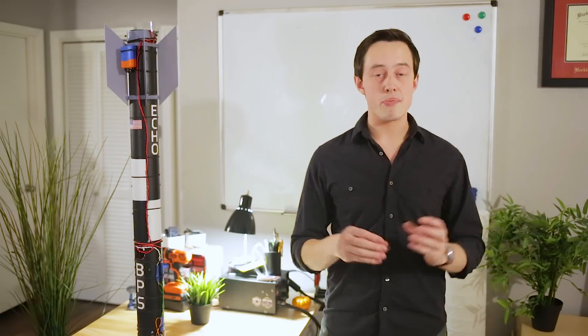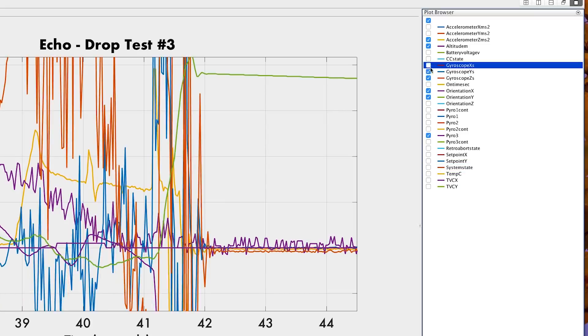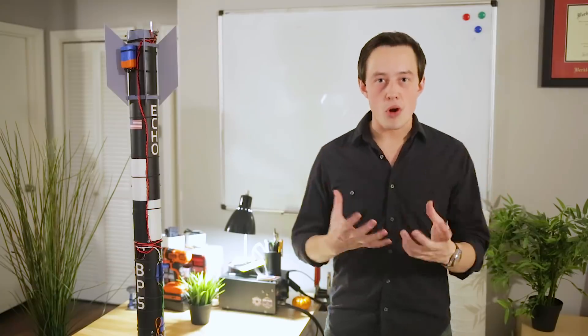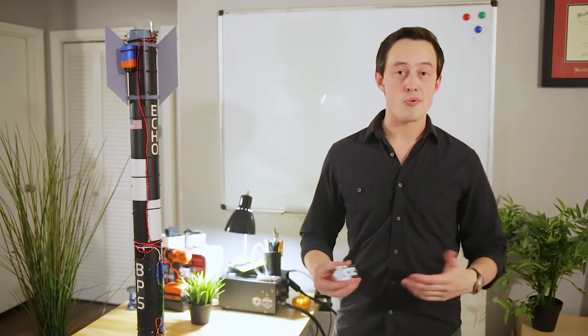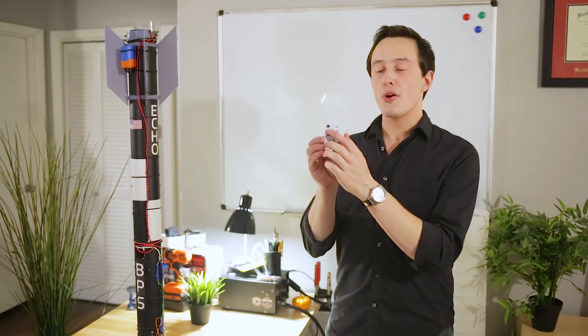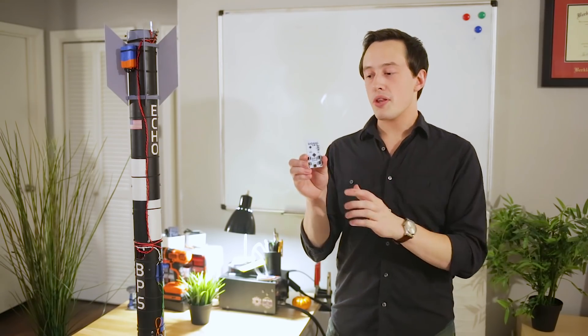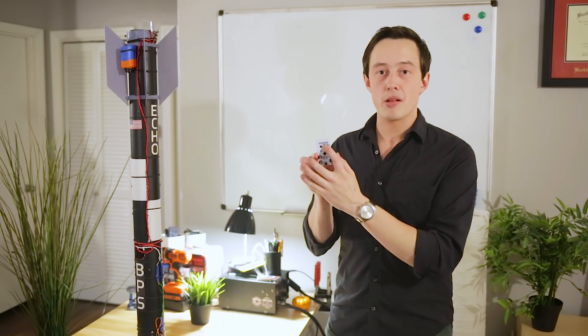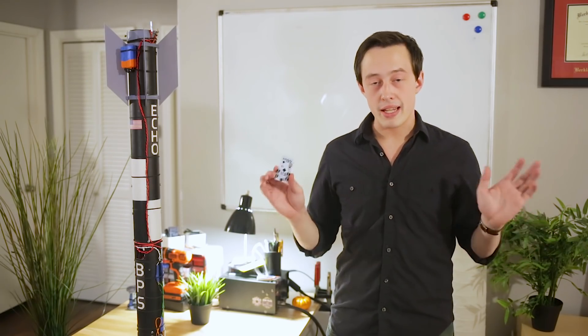I have all my flight data set up in a MATLAB plot here and I'll show different parts of it as we go through each part of the test. Before the test, I let the rocket warm up on the ground — and I'm not even kidding, I let it warm up. The PCB has a voltage regulator on the back that gets a little bit hot sometimes, so I let it warm up so that the IMU can auto-calibrate before it's time to actually test, which makes things a lot more accurate in flight.